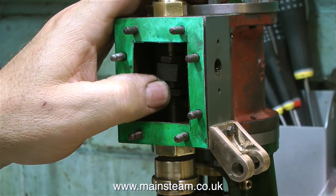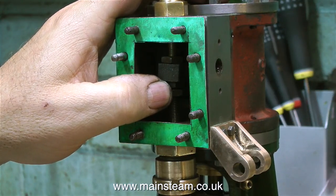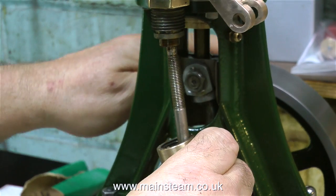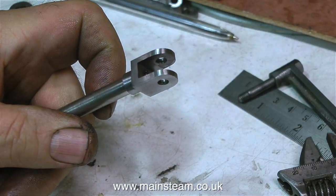This is not a difficult job - the engine is not yet fastened together completely. If it was all completed then it would be a pain, but at the moment it's easy. All I have to do is remove a couple of nuts from the valve chest studs, remove the valve chest cover, and then I can unscrew the entire assembly. And here it is.